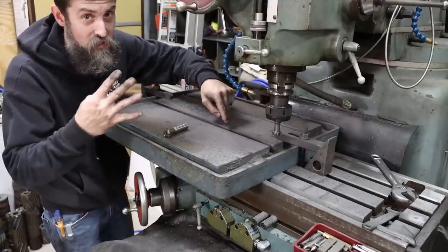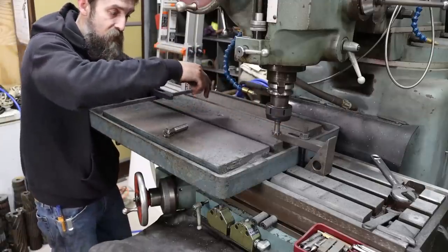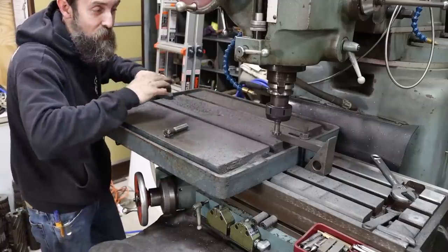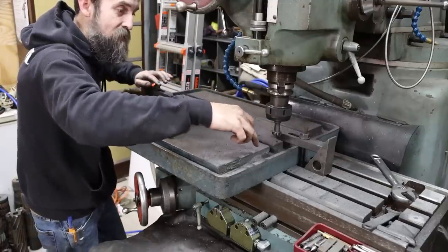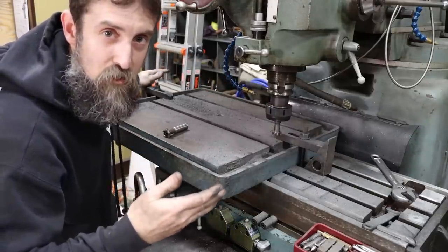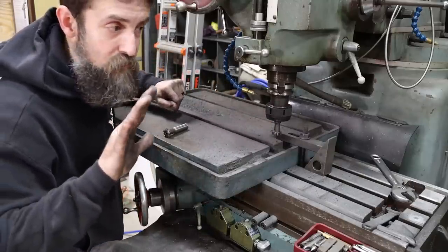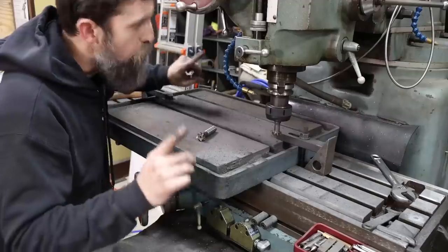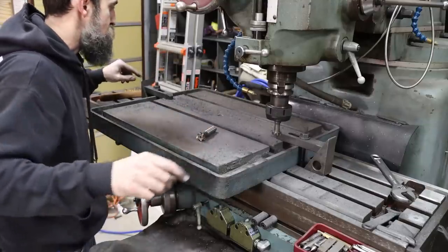But I didn't show it, but I went through this slot four times. The reason for that is because this cutter's a little small, and I have to offset. I did the bottom, did the top. First, I went through the direct center, right? So five times I had to go through this slot, directly through the center, offset to the side, offset to the side on the bottom, then bring it up to the top. Does that make sense? Right? I didn't want to show all that, but you get the idea. To get the slot to where it's to the factory size, works nice, five passes. Chewed up that cutter, and now it's time to swap out cutters and do that back one, and hopefully it won't be any worse than this one, or else I'm in trouble.